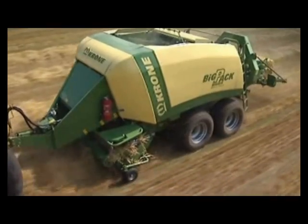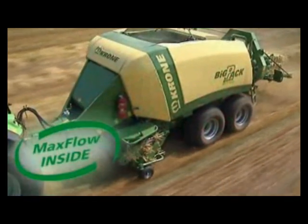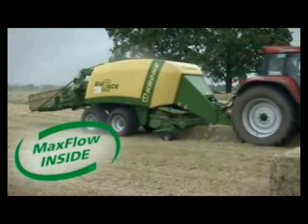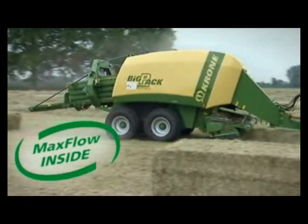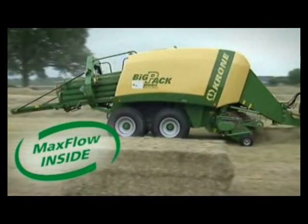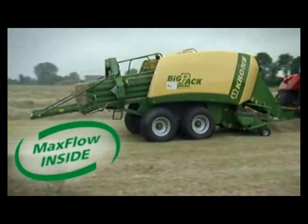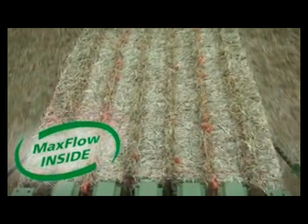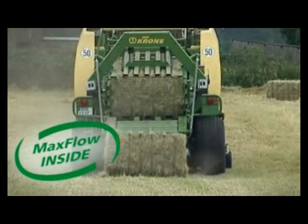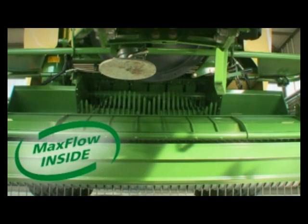The variable VFS filling system fills the chamber to the brim and ensures uniform bale densities at all times. There are five rakes and one feeder rake that work inside the Big Pack VFS chamber. The VFS system collects the material at a retainer until a sufficient amount of material has built up in the VFS chamber. Then the feeder rake feeds it into the baling chamber. VFS ensures that evenly sized parcels are fed into the baling chamber. The baling chamber is always filled with equal portions of material.